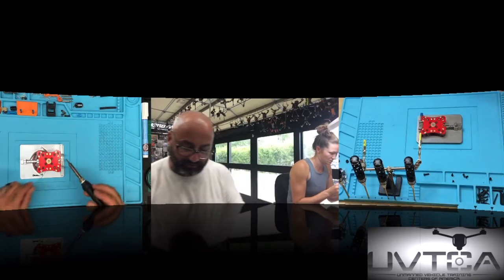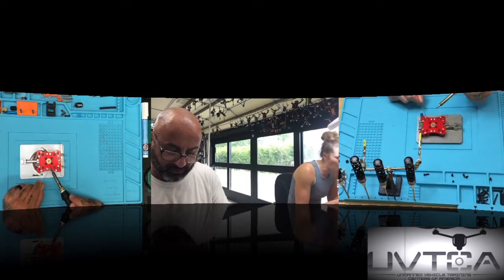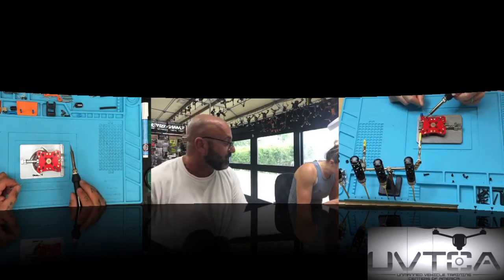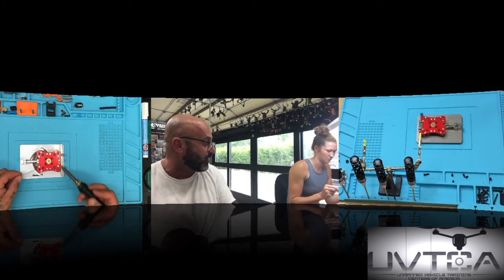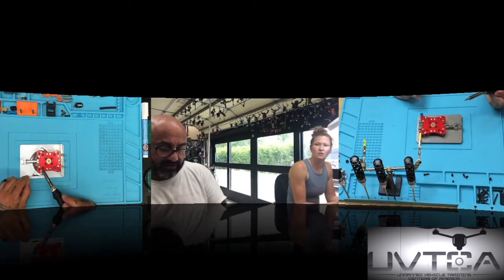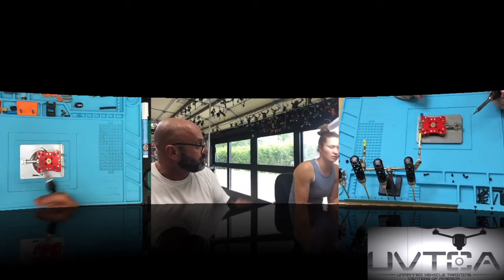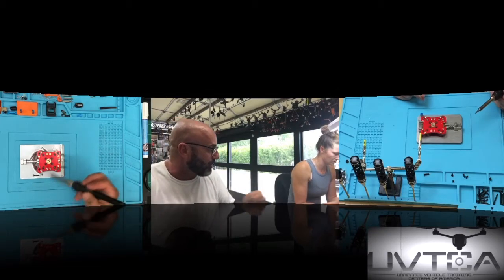Okay. All right. So we're gonna go ahead now, and I'm gonna do the ground also. There you go. So look, here's the thing. You don't have to be worried about staying in the lines. That's why we put flux on here. So watch, if I just take this and I go all over the board, it's still gonna stay in that square because the flux keeps it in that barrier. So just don't worry about it so much.